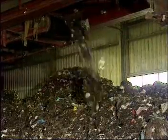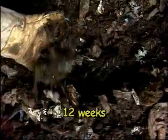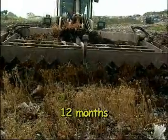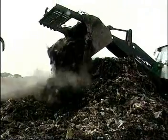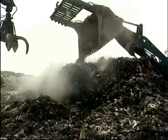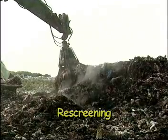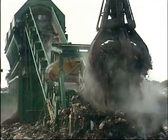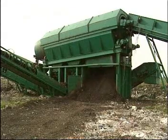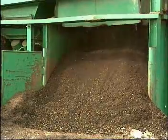The fully automated, optimized mobile composting process takes only about 12 weeks. A simple, non-mobile outdoor heap composting process can take as long as 12 months. Re-screening of the treated waste marks the end of the aerobic biological treatment process. The composted material is carried off and loaded into mobile drums for screening directly at the landfill. The finely screened material serves as biological filter material for new heaps.